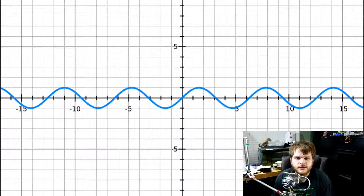The most notable difference between single-phase and three-phase power is that three-phase power uses a third conductor. This third conductor allows two additional phases to develop. Some graphics will probably help. This first graph is a representation of what comes out of your outlet. I should mention that these graphs are not to scale in any way, shape, or form — they're only for representation purposes.